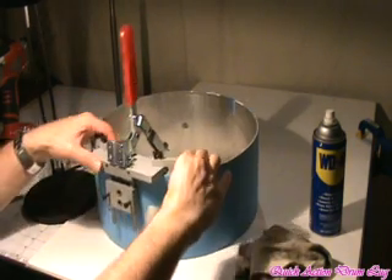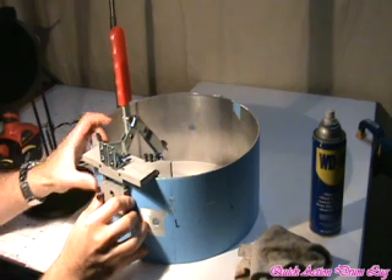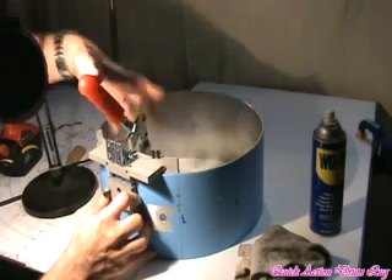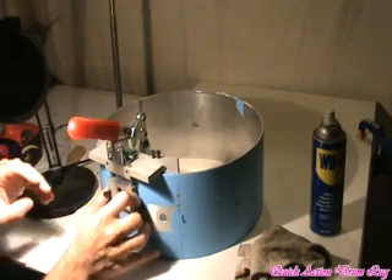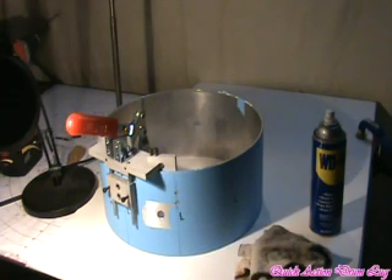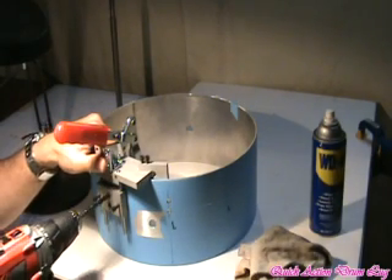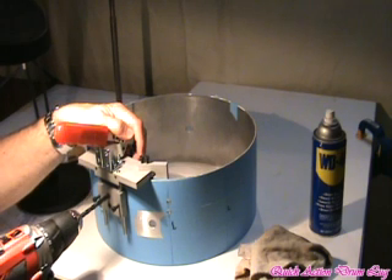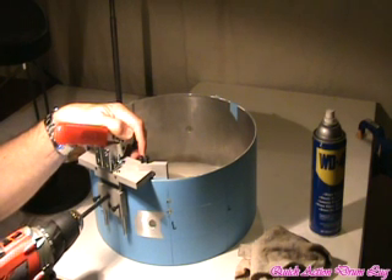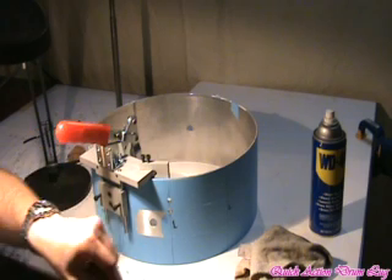For this thin aluminum shell, the hardwood actually helps from the standpoint of being able to clamp onto the shell. We'll get it lined up with that V-notch and centerline — don't pinch your fingers. Now that's clamped on, so we can drill these holes. Very good, it cleaned itself out.